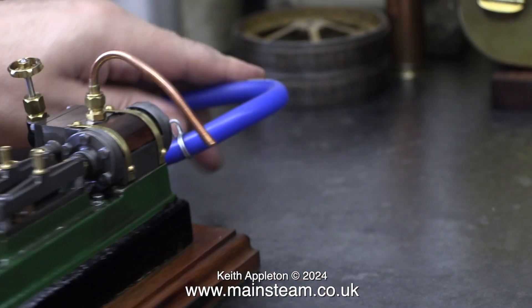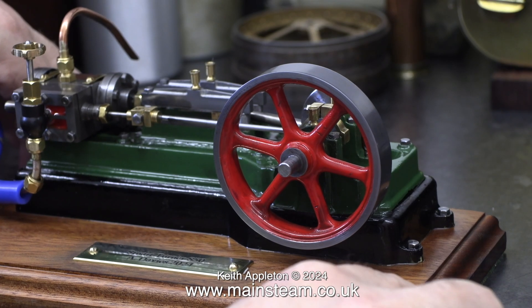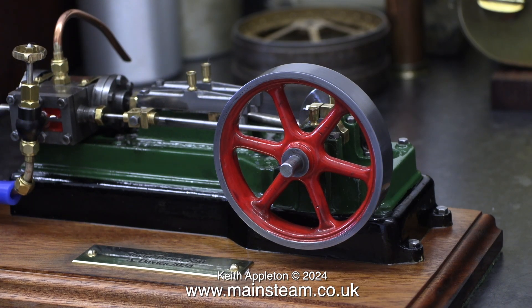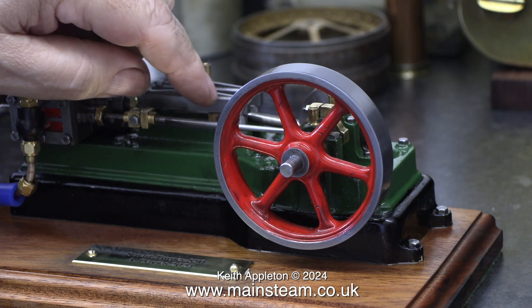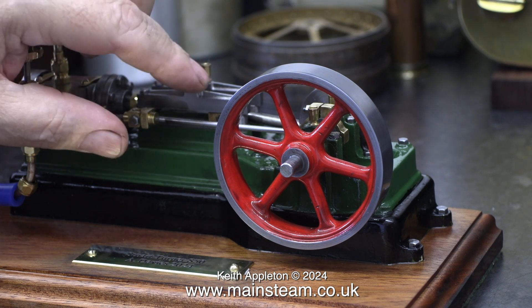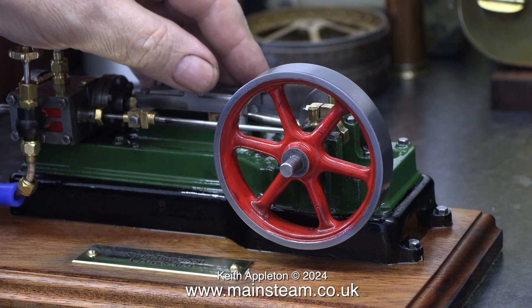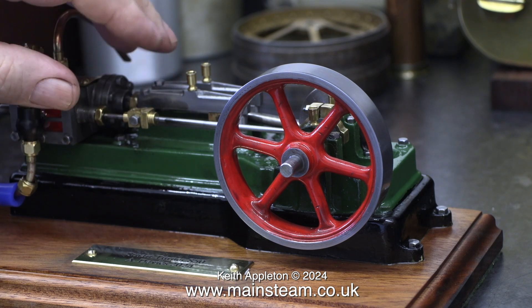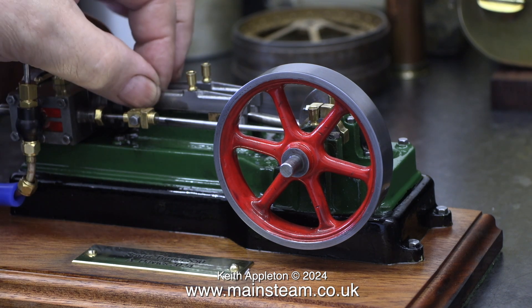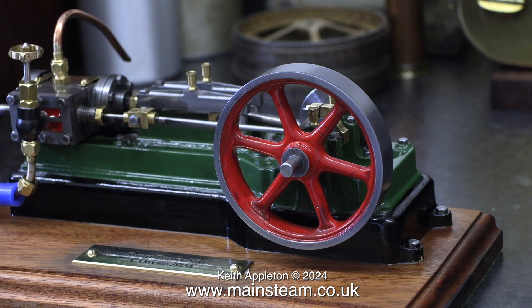I don't really like making the plates that they supply. What do you think Keith? I think it's nice, it runs well. I think they need machining a bit thinner — they're a bit too lumpy. I see where you're coming from making it match the bottom, but it's a little bit, dare I say it, over scale. If that was thinner where it was supposed to be, had you used the standard metal to mill the fancy bits it would have been alright. But it's a bit thick. But that's just me being picky. The timing was just a tiny bit retarded at each end.